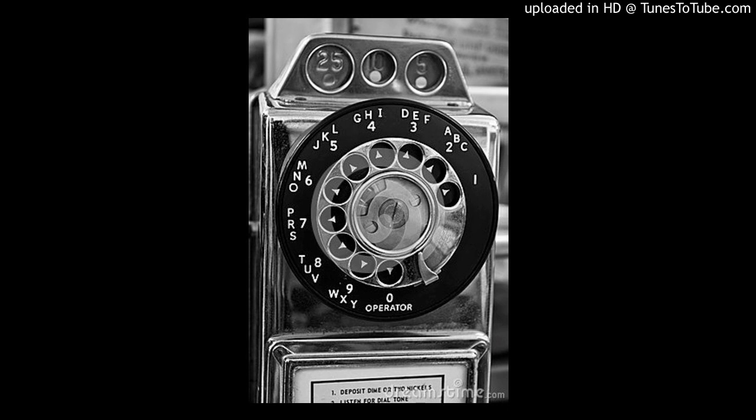Now let's move on to post-pay operation, which is so common among many of my phone trips that half the time I don't even mention it. In independent companies, post-pay operation is very simple because it's all done by the coin phone. You can dial local calls freely, and the call just goes through. But the polarity reversal on the phone line when the party answers triggers something in the payphone itself to cut off your mouthpiece so that the party cannot hear you until you make the initial deposit. Once you do, your mouthpiece is connected and you can talk. There is no coin collect or return signal because every coin dropped into the phone goes right into the coin box. If you deposit too soon, you lose the money.